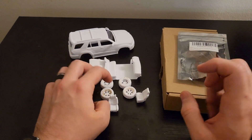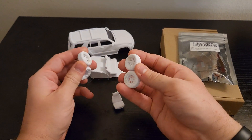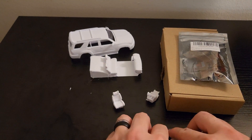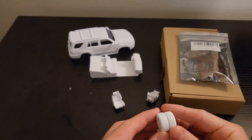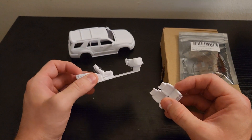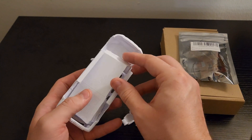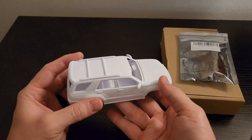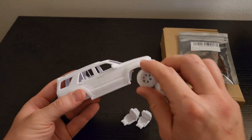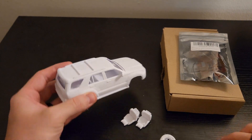We are looking at potentially wrapping up the printing and actually building this vehicle now. As I previously mentioned, these were 3D printed with PLA+, so they're a hard material. Instead of reprinting with a softer material, I'm looking at potentially repurposing a remote control car. The original plan — which would still technically work for just printing out a mock vehicle — would be to have these tires and wheels, stick the interior piece in, slip the interior into the body, print out the bottom plate to secure everything, and then finalize by putting on the wheels. However, that would mean making the entire toy suspension portion ourselves.